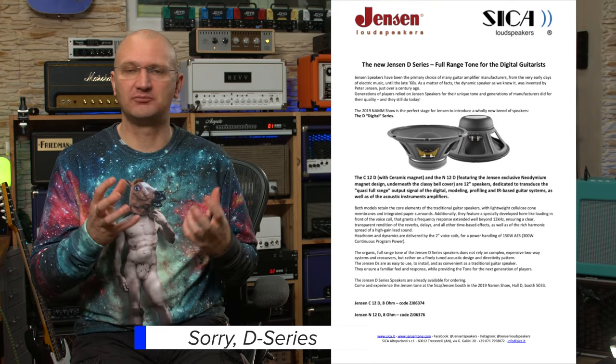So that tells me a whole bunch of things. That tells me that Fender designed the ToneMaster to be what the Deluxe Reverb was supposed to be, a clean amp. And it focuses on that and it does it amazingly. It shows me that Fender focused on making that speaker to be the clean speaker. Now, when I'm driving the tube version, the low end goes away. It is less low endy than when I'm playing clean. And it gets very mid-focused, whereas the ToneMaster blows up the low end and the mids kind of go away. So that's why it sounds so drastically different when you play them A-B.